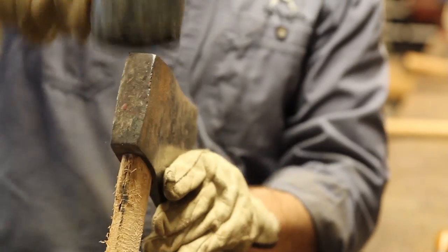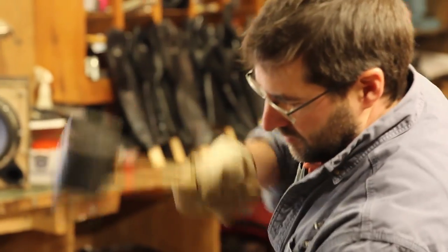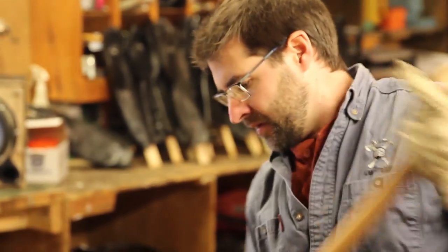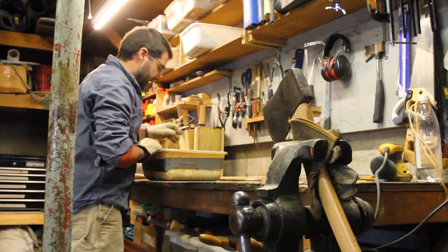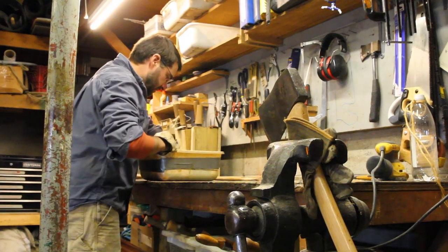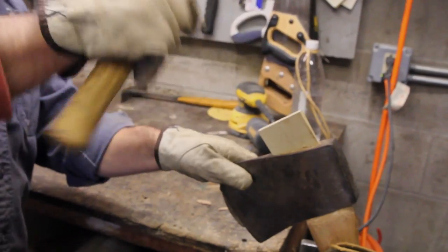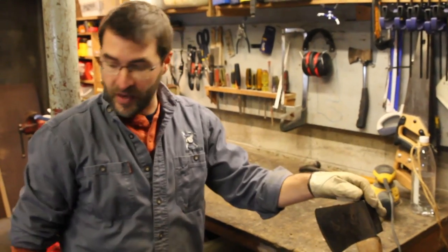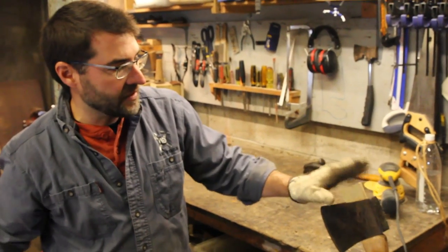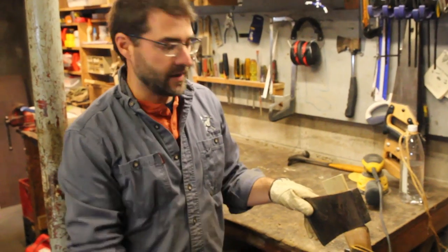Give it a little bit of a tap to get started. Find the wedges. After a few test swings, if the head is loose, I might be able to tighten that up more by driving that wedge in more. So we want to give ourselves stuff to work with. The very last step in our hanging process will be getting rid of that excess wedge.